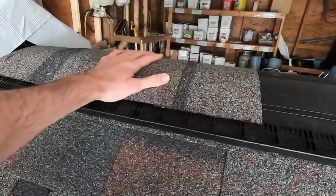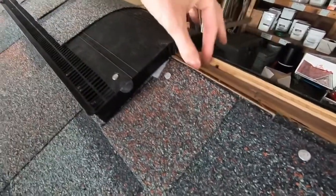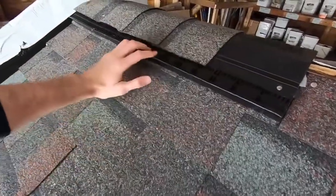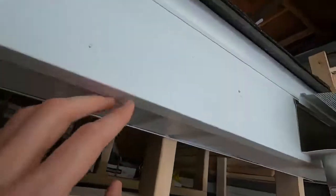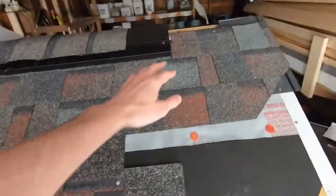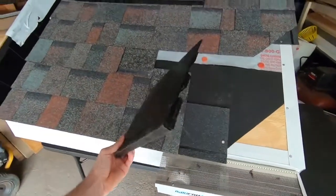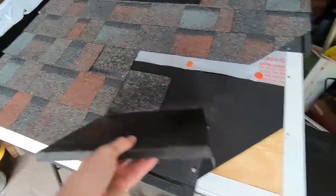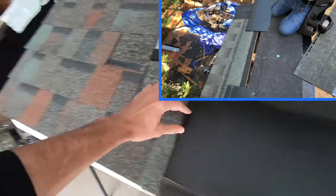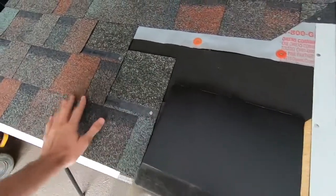This is the ridge vent and the ridge caps. Right here is the opening cut into the attic space so that heat can come out and vent through this vent. Down here we've got the soffit, which is open soffit so air can come up into the attic space and out the top. If you don't have soffit, you can use an inflow vent where air comes in — you cut a slit into your roof, put the vent over it running all the way down, then put shingles over top so you wouldn't actually see it.